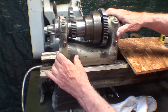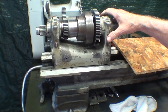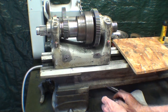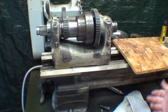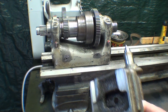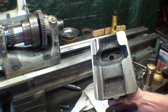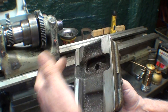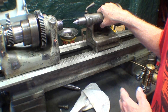Now it slides — I'm sliding it on the oil. And I have a location mark that I put on there. But I'm not going to bolt it down yet. Remember, it is held down with two clamps and two bolts from underneath, and I may have to slide that off to get one started. Now the tailstock is right here — this is also clean. I've still got a few chips there, but I'm going to lay that on the ways also.